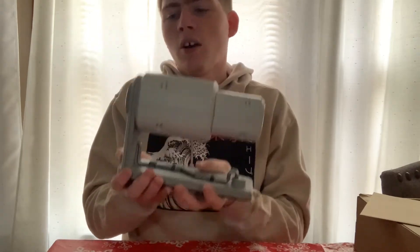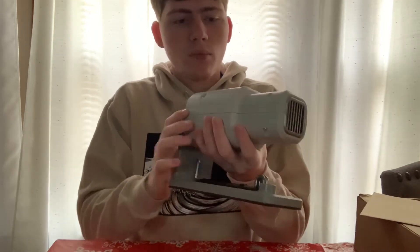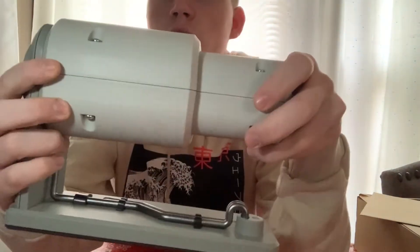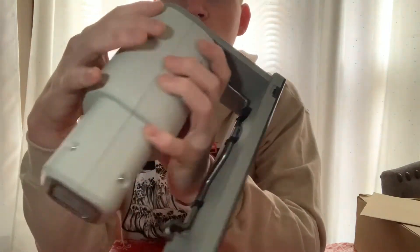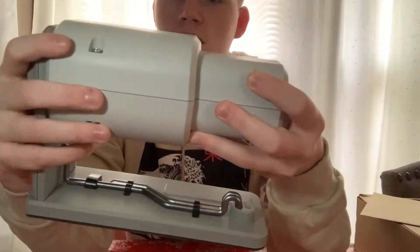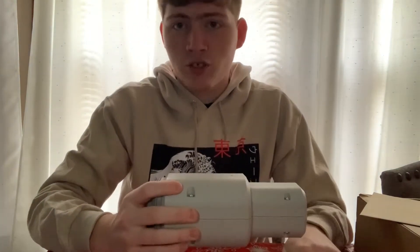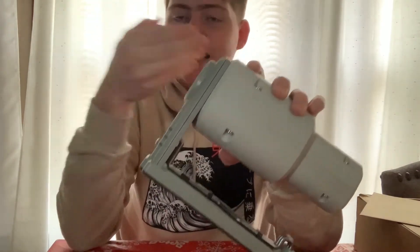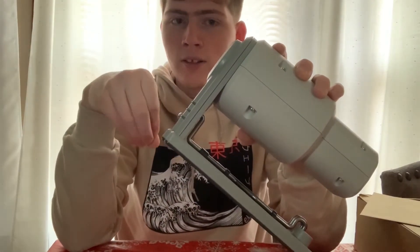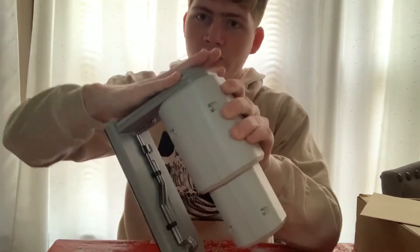It's heavy — it has some weight to it. The weight comes from the speaker, which has a good solid weight to it. Building this thing starts with the tube in here — if you can look in there, you can see the speaker. Then you build the tube structure and build this piece right here — it looks like it's from the Fallout universe. Then everything gets encased. You actually have to bring the wire through, push the acoustic webbing through, pull the wire through making sure it comes out correctly, then put on this back piece, bring it down, plug it into this piece, and slap it all together and put some screws on it.